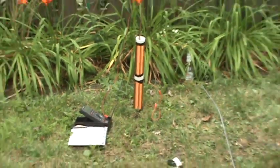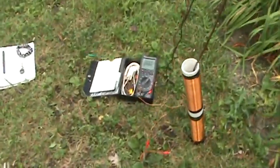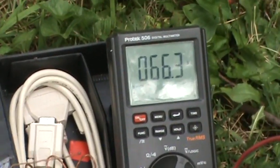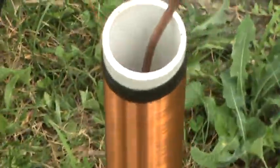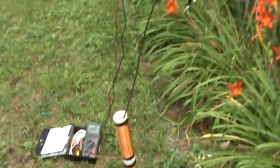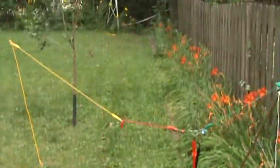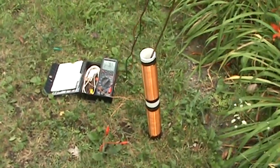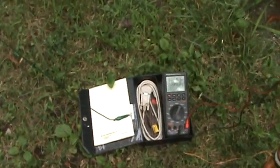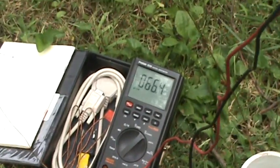So you can see now our readings right now with two coils — 66 volts. It was a lot higher than that today. The ground is a lot harder and I'm having difficulty getting my ground rod in without actually digging a hole. The ground rod when I was back in that corner was about another 12 inches deeper, so I'm only about six or eight inches into the ground right now. That's why I'm getting a lower reading, not because I'm away from that corner.